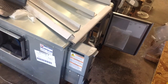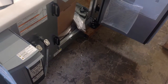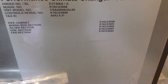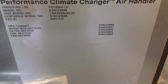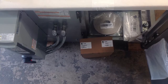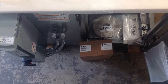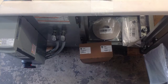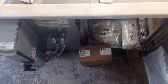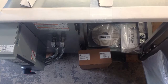Now we're looking down at the variable frequency drive and the door open to the supply fan section. There are several loose control components that ship inside the supply fan section. This is a close-up of the nameplate for air handler 3-3. You'll also see spare gasket material for the doors, and the other box is the display that snaps into the front of the control panel door — that display ships protected in a box, and we'll cover how it connects during training.